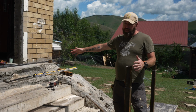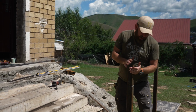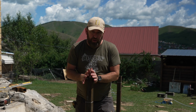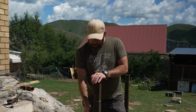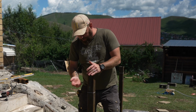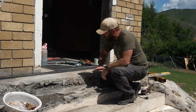This is the entrance section. It is going to be a 2.5 meter by 3 meter entrance, which we're going to have stairs on this side. On the last episode, we were able to install these three posts, and we wanted to get them concreted into the ground and steady so that we can then mark off and cut. Of course, we're not going to have a ledger board, but this is going to be the height of the deck boards,